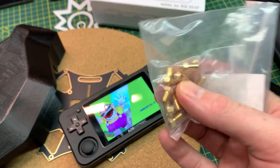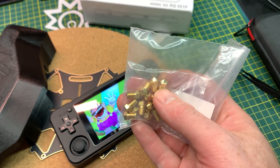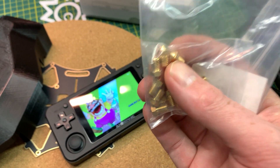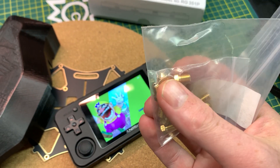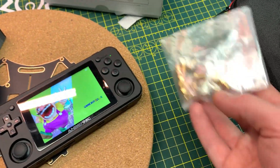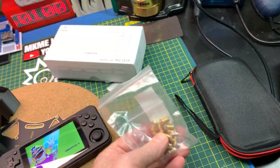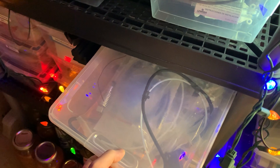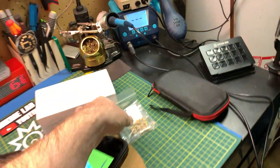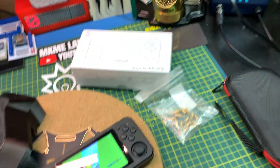Some 3D printer nozzles - that i3 I just showed you, my favourite printer of all time. I finally had to change a nozzle after all these years. I've never clogged a nozzle, but I baked one because I ran it without the filament sensor, ran a big print with very little PLA left, ran out of filament and cooked one. I could probably clean it out but I have spares - a whole box of 3D printer goodies. Now I have enough to last me four lifetimes.